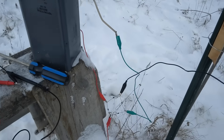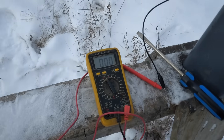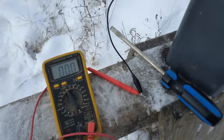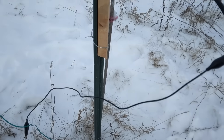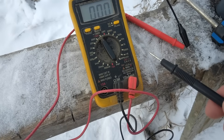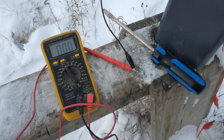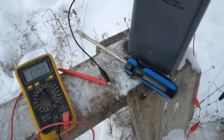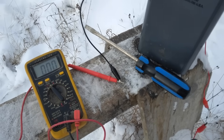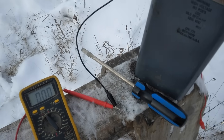So now this will start charging up. I got the voltmeter set. I couldn't get an AC reading on this because it was overranging the meter and I was afraid it was going to damage it. I just touched it there and it started beeping, so I didn't want to try it again in case it might wreck it. I'm going to slowly charge this capacitor up and see what we get.